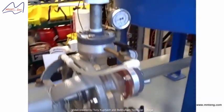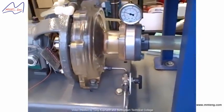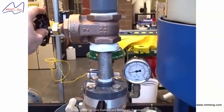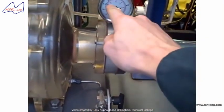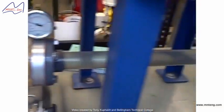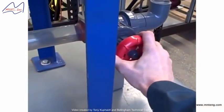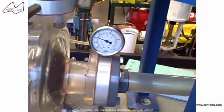What I'm going to demonstrate here is cavitation. We're going to purposely cause cavitation to occur in the system. We're going to do so by keeping the discharge valve wide open like it is and pinching off the suction valve. What that will do is reduce the pressure in this line, and you'll see this compound gauge show a stronger and stronger vacuum as we begin to pinch off this valve. I'll start to turn this clockwise and you'll see the gauge's indication go down.